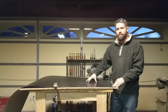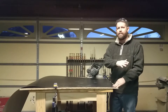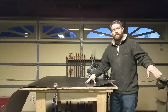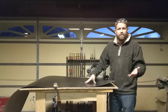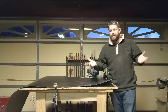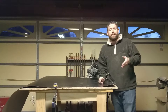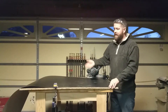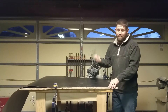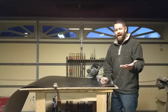The last video we're going to show on the rocker box is cutting the formica. I want to show this because I don't believe I showed it when making the mirror box. In this series I will show how I cut the formica, and I won't bother with the video on laminating it to the bottom — I assume we all know we're going to square it up, apply contact cement, and laminate it down. The rocker box is just over 21 and a half inches wide — it's a square, 21 and a half by 21 and a half. I made this just a sixteenth of an inch smaller, so 21 and 7 sixteenths, and I'm just going to cut it freehand with a circular saw.